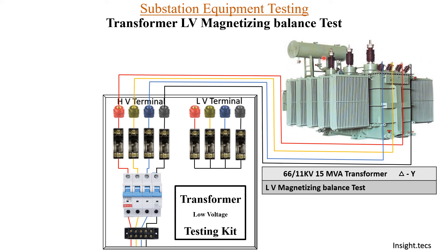We will completely disconnect the HV wires. The tap position for which we will perform the test is step number five. The reason is that in this kind of transformer, the OLTC is generally on the HV side, and on the LV side there is no OLTC and no taps. So when giving the voltage supply on the LV side, we will be giving it at the normal tap position of the transformer only.